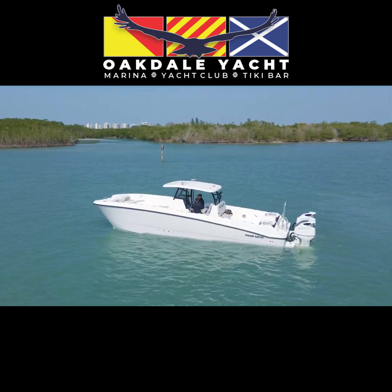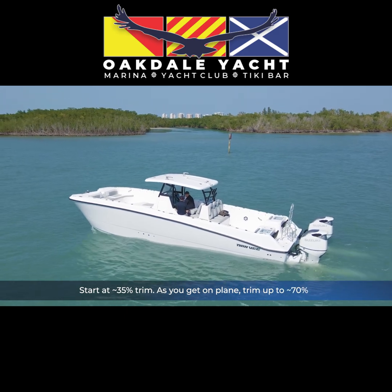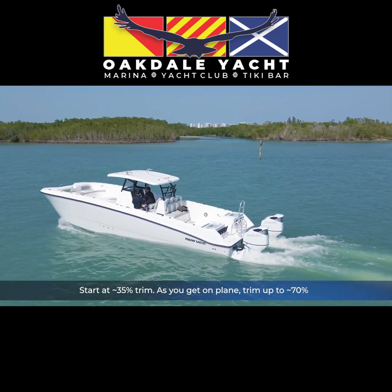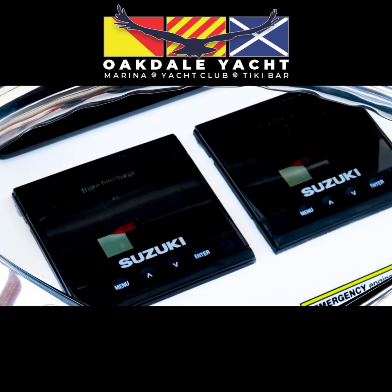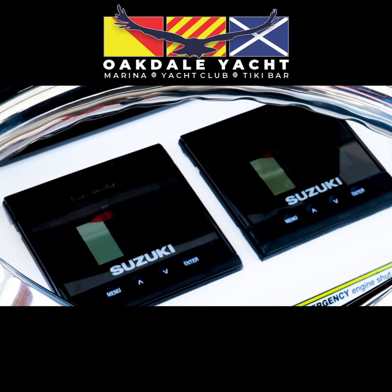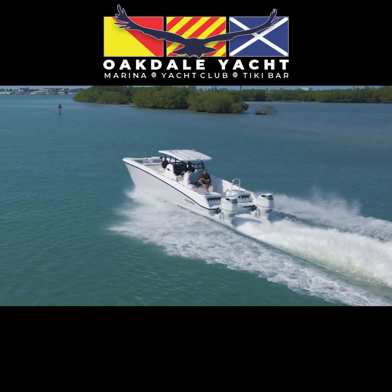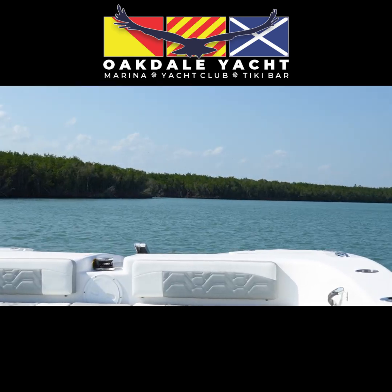Remember, as we take off, we can start off at approximately 35% trim. When I take off and get it on plane, as I'm taking off, I'm going to trim up like this. From 35 going all the way up to 70. This will give you the most performance, optimizing the tunnel of the Catamaran so that you get the best ride possible.